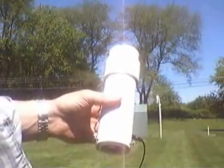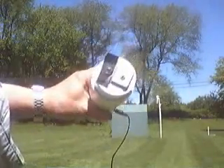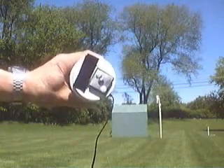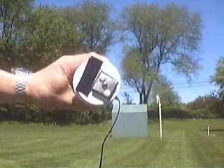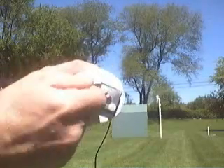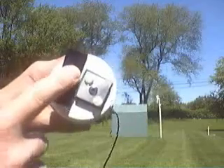It's about 9 inches long and takes anywhere from 7 to 12 volt power input. It has sensors on the front. There's a small thermopile that measures cloud temperature, and around it is a heat sink with a small heater — about 0.2 watts — that keeps it warm so dew doesn't collect on it. There's also a cadmium sulfide photocell to detect ambient light conditions, and I'm going to cover that up to simulate darkness right now.